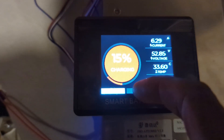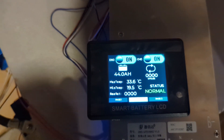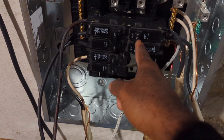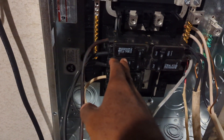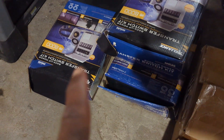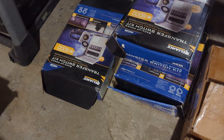I have not top-balanced this battery yet — I'm still waiting for the charger to charge each cell individually. I use a separate electrical panel with both inverters feeding into a 60-amp circuit breaker making 240 volts, and then a 40-amp breaker going to the first transfer switch, powering a lot of stuff in the house — the kitchen and two bedrooms. I have a total of three transfer switches planned for the whole house.